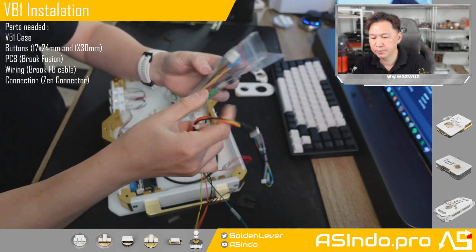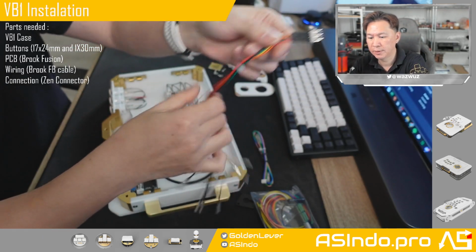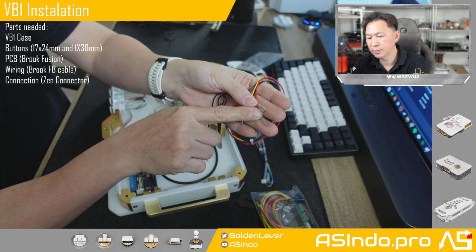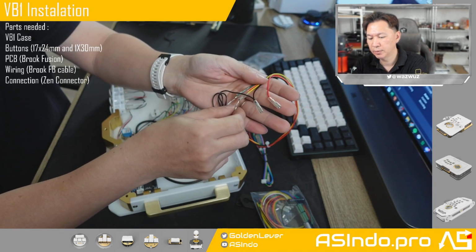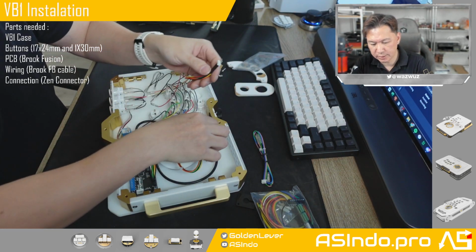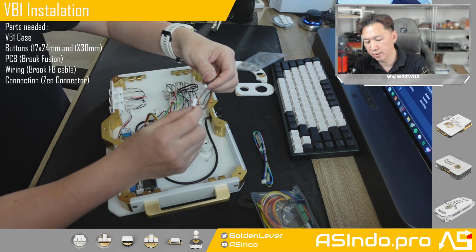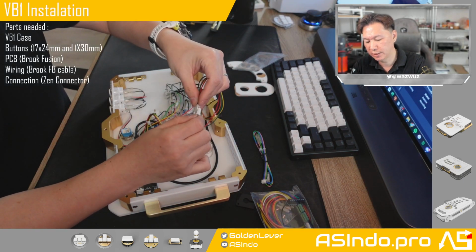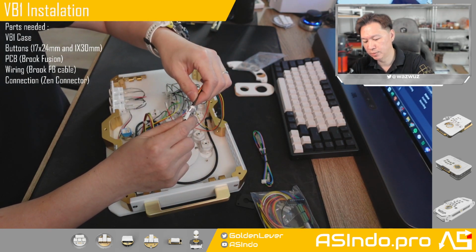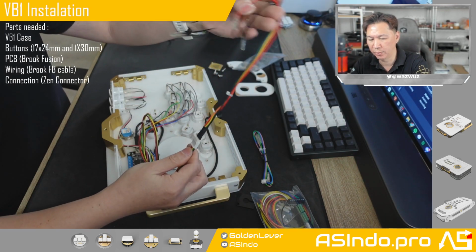It's 5-pin. This is a 5-pin male to 8-pin male. This is a 2.8 millimeters quick disconnect, so it's for arcade buttons. It's easy, you just follow the black color, black will go to the black, or you cannot install it in the wrong direction, it's just not possible. So it's error proof, no problems, don't worry.